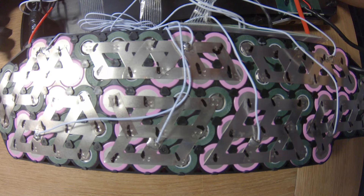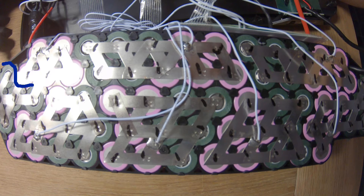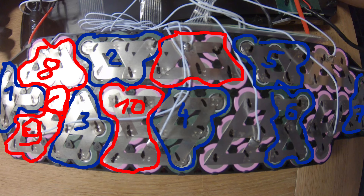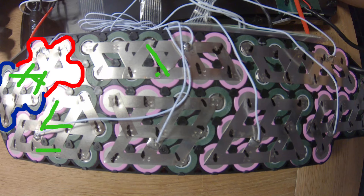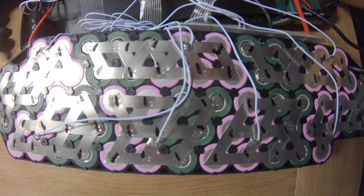As we can see, this battery is made out of five cells connected in parallel, and then 14 of these parallel groups connected in series. If you've never worked with battery packs it might be hard to imagine, but if you look carefully you'll see that two groups of cells connected in parallel are connected to each other on one side of the battery, and then connected to the next group on the other side.